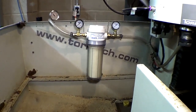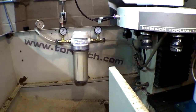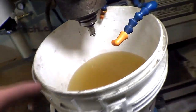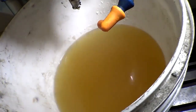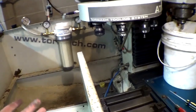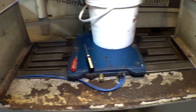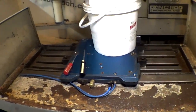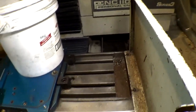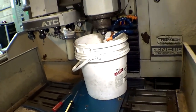I'm running a synthetic coolant — it's relatively clear and yellowy. Already this is quite a bit cleaner looking than normal. Normal coolants are white and milky looking, but I like this one because it's clear and you can see through it when you're machining, so I can zoom in on the cutter and actually see what's going on. However, I think the synthetic is causing a lot of my rusting issues, so I think I need to switch to an oil-based coolant — that's why every machine shop everywhere uses an oil-based coolant.